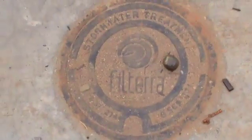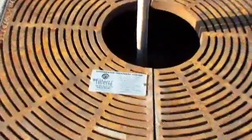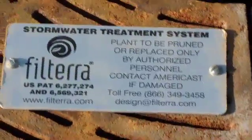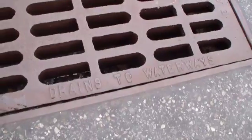Maintenance workers can also check the clean-out pipes by removing the miniature manhole cover. If you look through the clean-out pipes and there's water standing in those, it may be a pipe that's clogged. That should be able to be maintained with standard plumbing equipment. If you do have a pipe clogged, plumbing equipment can normally be used to troubleshoot clogging issues. But a municipality is encouraged to call Filtera representatives if it continues to have difficulties — the company will readily offer guidance and suggestions to pinpoint the reason for any malfunction, so your Filtera can continue to successfully mitigate stormwater pollution.